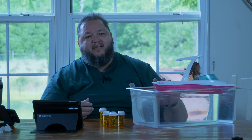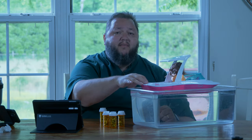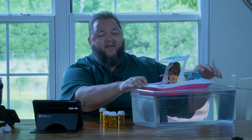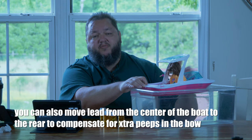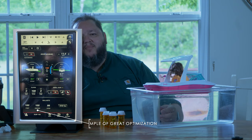Using lead to help get you the exact pitch and roll you want and maximizing your ballast system is awesome. I have friends on some of the best boats out there — like the Supra SE 550 or the SA 550, two of the best boats I know of — and there are also great ones by Mastercraft, Correctcraft, and Centurion. Everybody I know that is a hardcore wake surfer uses some lead. Some are crazy — like 1,000 or 2,000 pounds — and I don't think you need that much. But everybody uses a little bit of lead to tune and get the maximum out of their system. Maybe you're a big guy and you sit on one side of the boat and you put a little more lead on one side to counterbalance. You adjust your lead accounting for how you normally ride with your crew so that you're always getting almost 100% ballast and your perfect pitch and roll, and if you do that you're going to have an incredibly consistent wake that is always great.